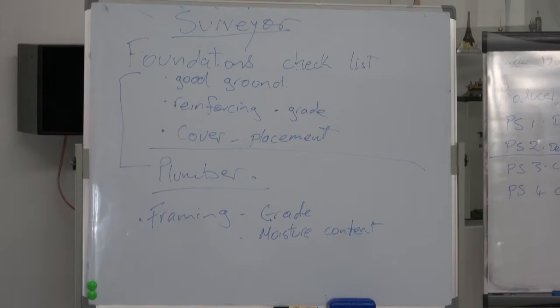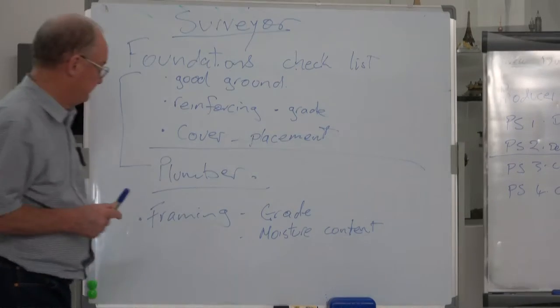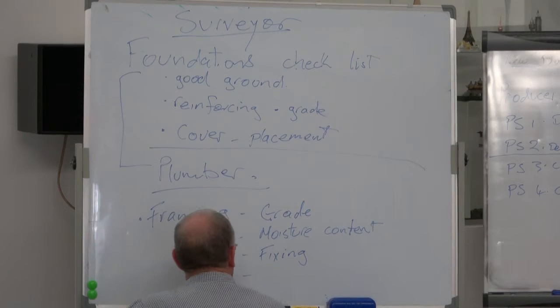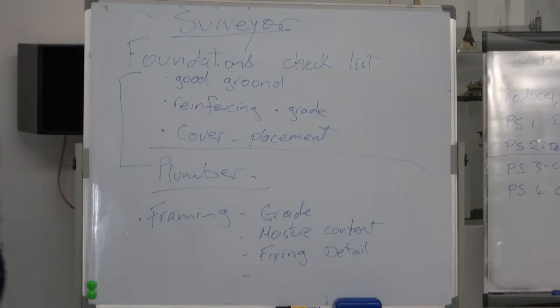Make sure when you've got bracing, when you've got separate bracing on the separate walls, wherever you've got framing, follow the plan, and if it says put a brace there of a particular style, put it there. Don't just say to the building inspector, nah, she'll be right, no, we don't need that, because he's not going to accept it. So I could write a whole separate checklist on just framing as you work through a house.